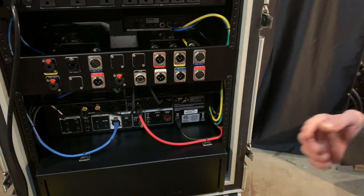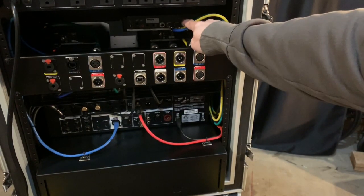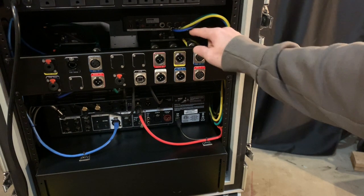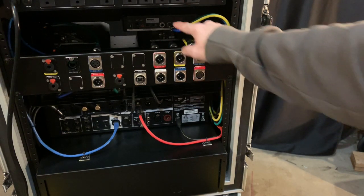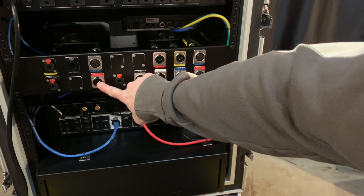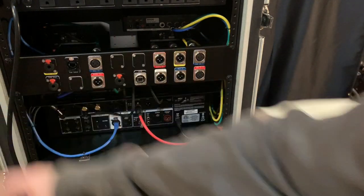And then from the front of house, we'll take an in-ear mix. I have 2 channels, and that's wired to the inputs of my in-ear transmitter. And then I've got a pass-through on one of the channels. So for channel 2, the pass-through comes out of that unit and feeds the monitor output, which goes to the front of the stage for me. And so that's kind of how all that's wired up.